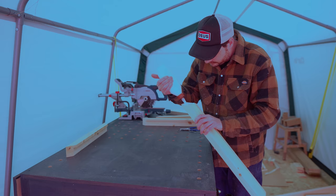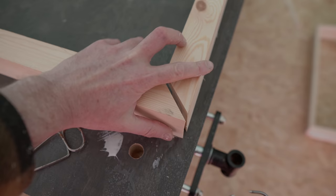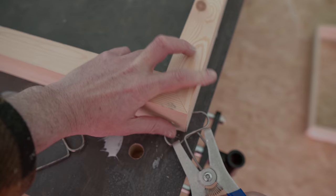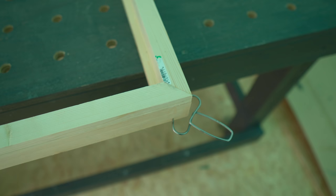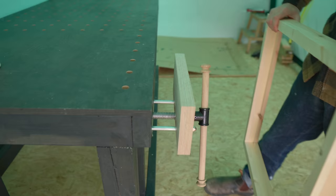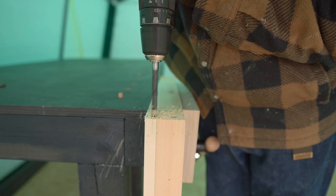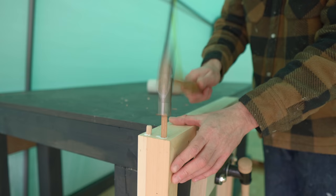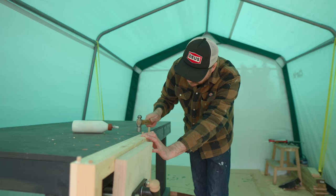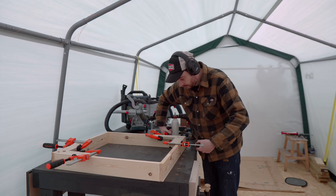The frame gets glued together and clamped up using some Collins mitre clamps — I'll put a link to those on the tools I use page as well. Once the glue's dried on the mitre joints I'd like to reinforce them, so I use some 10mm dowels, drilling down to get a couple into each corner. When dry I trim them flush and sand the whole thing down. I start the holes with a Forstner bit because it leaves a really clean hole, then finish with a normal wood bit. Then glue goes in and dowels are tapped into place.